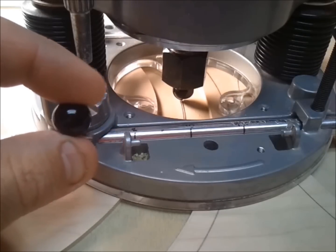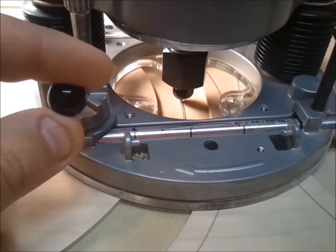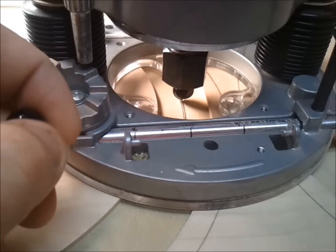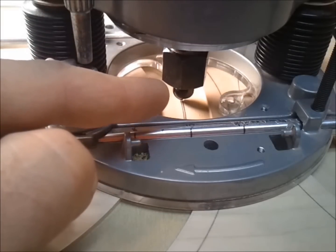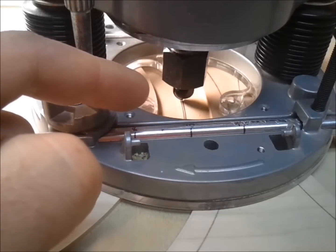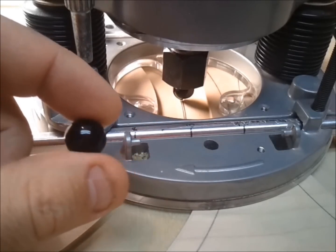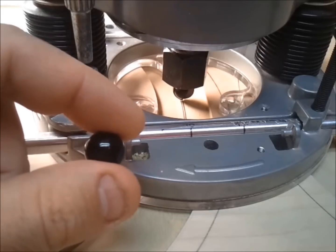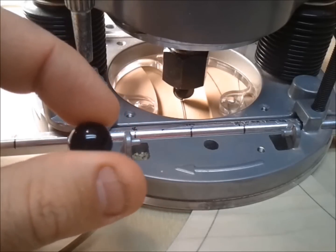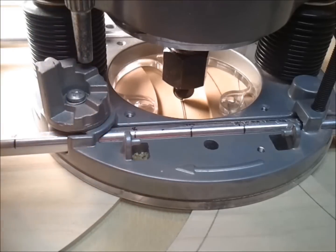These marbles are a little bit bigger than a 1/2 inch, and my round nose bit is exactly a 1/2 inch. So I have to make my first pass favor the right side, and then the second pass will favor the left side. The difference is only a 1/16 of an inch, just enough to inconvenience me. If you can be lucky enough to find 1/2 inch marbles, you can do it with just one pass.